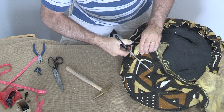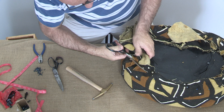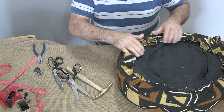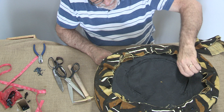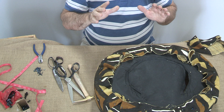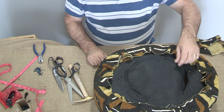Trim it up. Now on this particular piece I've got plenty of wood on the bottom. I want to fold this and tack it and be done with it, because I really want to keep this zippered cambric — it's very important for shipping purposes so we have the option of putting our legs in for shipping. Normally in a reupholstery project the cambric comes off and you'd tack this all the way in and then put another piece of cambric on. But we're keeping the cost down by reusing this, and the existing underlayer provides a nice base for the mud cloth.